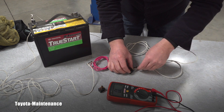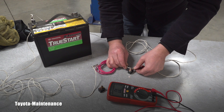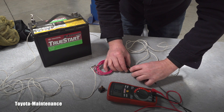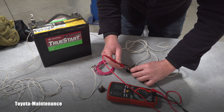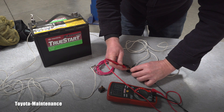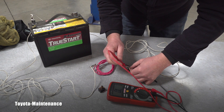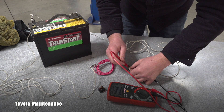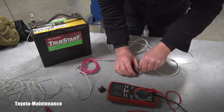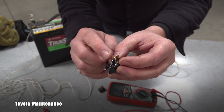Let me confirm again — applying 12 volts right here carefully. You heard the clicking, so the relay is energized, and there should be continuity between these two switch terminals. It's a little hard to hold everything at once, but watch the multimeter — there is not an open anymore. We have a closed circuit, therefore this relay is working properly.